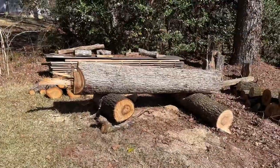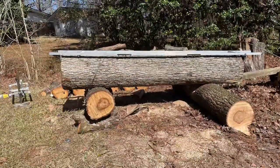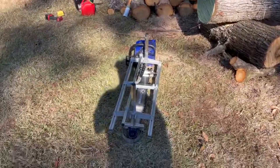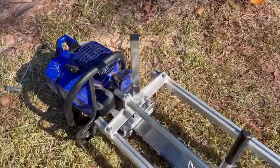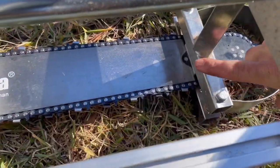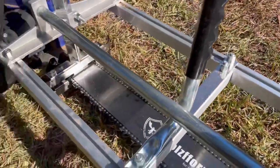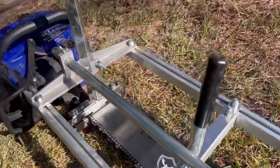Here's a tree I had taken down in my backyard — it's a white oak, and this is going to be the first one I'm slabbing up. So I get the edges cleaned up, get it painted, and then get my rails mounted to it. The mill itself is attached to the chainsaw. It's got two clamps that clamp the bar close to the motor and all the way down at the end, holding it at a set elevation the entire time you're cutting. So you need a flat reference, but once you have one, this will do all the work — it just rides across the top and slabs out boards.